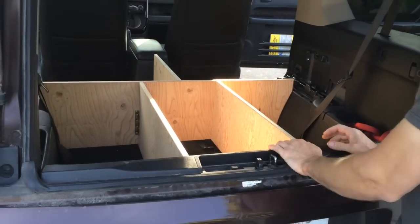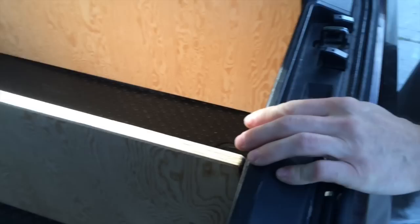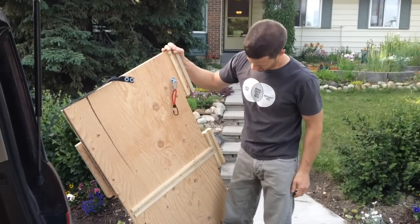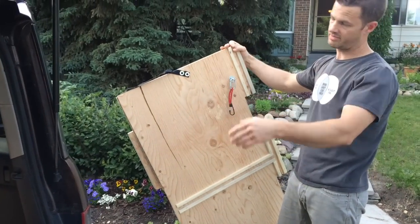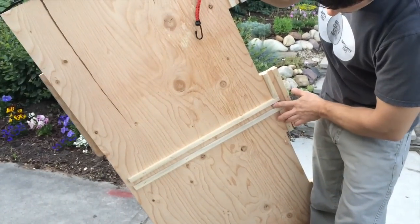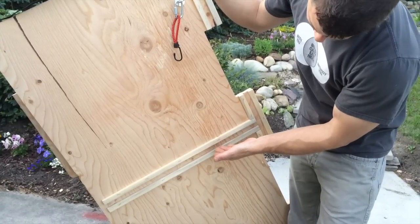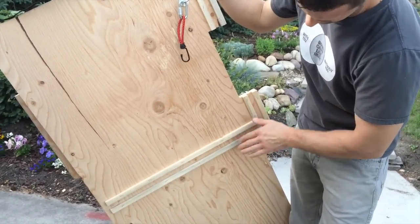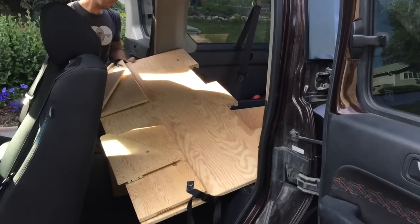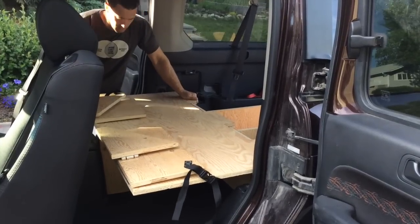You can see it's enclosed with lots of room to spare. This is the front piece of the bed. What keeps all of your vertical members in line and fitting together tightly are these little channels that I've made — they're just pine glued on. The three-quarter ply slots right in there and it keeps everything aligned perfectly.